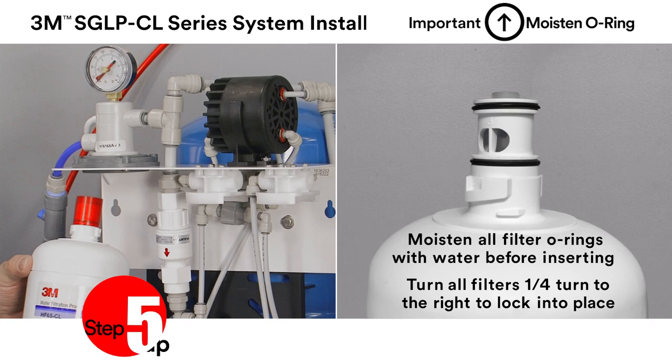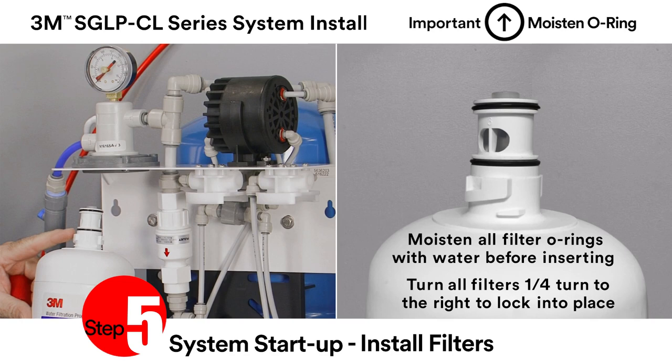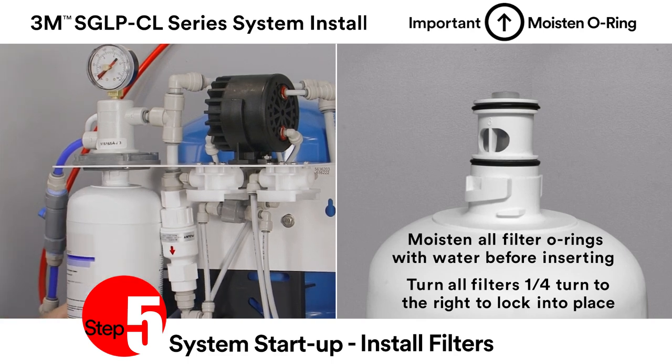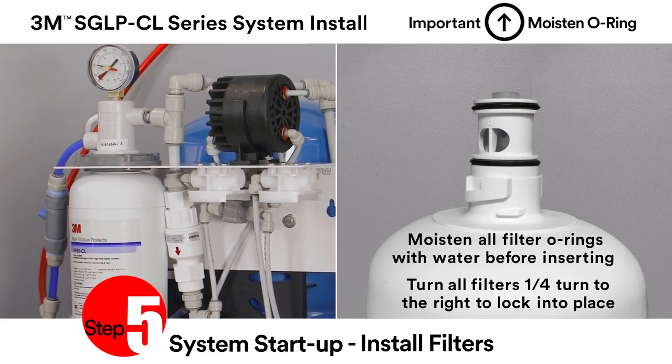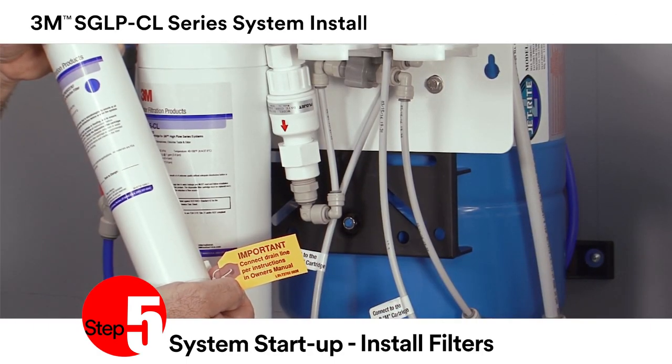Next, you'll be installing the filter cartridges. Remove the red cap from the HF65CL pre-filter cartridge, then moisten the O-rings on the cartridge interconnect with water. Insert the cartridge into the head and rotate 1/4 turn to the right until the cartridge stops. The left RO membrane is installed next.